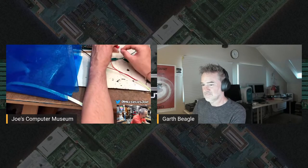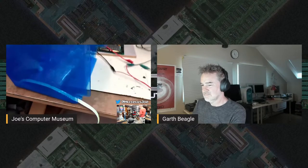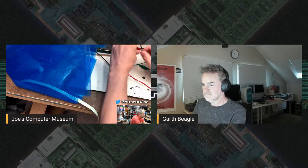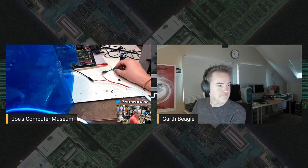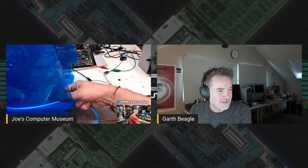So let's go down even further. So that was what, 120? Let's cut that in half. Let's go to 68. 68 ohms. We basically need to bump right up against the edge of the max wattage value of the resistor itself. Okay. That's 68. That looks pretty good. We're getting there. If it's not burning up, maybe it's close enough.